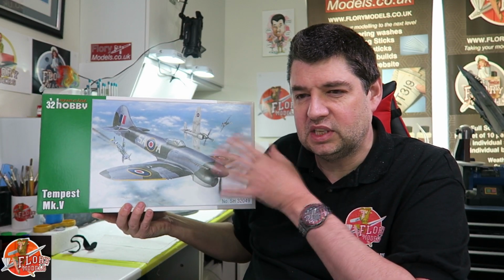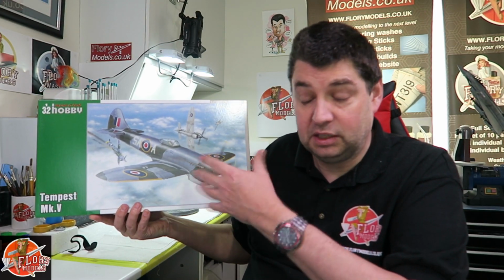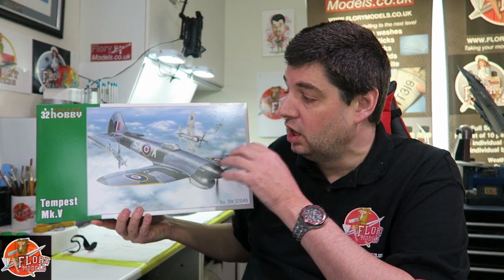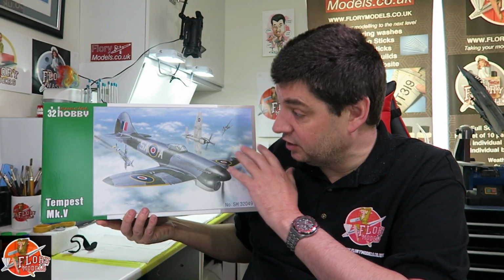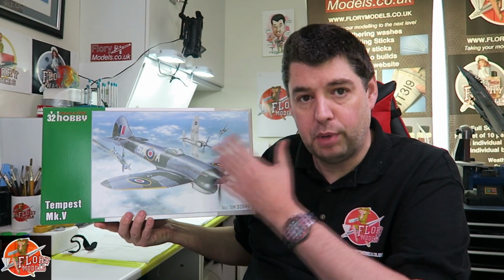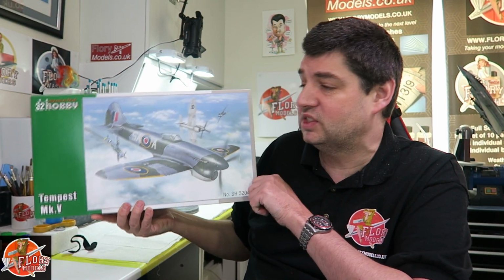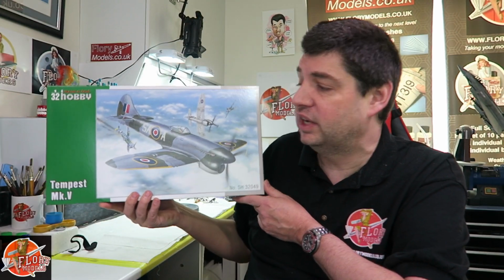And you can always see the way that it's been machined out. Usually the way I tell is that you look at the edges, see how sharp and crisp they are, and also the machining marks in the mold. If the mold hasn't been polished, hasn't been taken to a very fine edge, it tends to be more of a short run kit. So they're not expecting to sell billions of these things over the next 20 years.